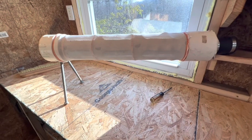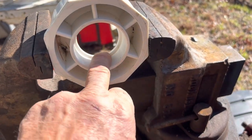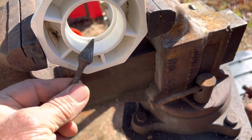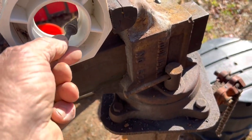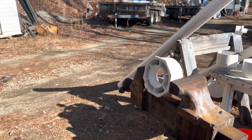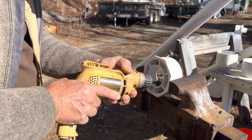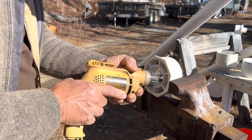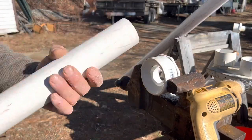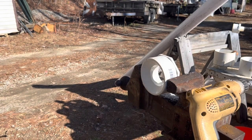Now I'm going to take this thing down there and put it in the spring. For part of this build, we're going to slide this pipe right through this thing. They've got this ledge right here where the pipe is supposed to stop, so we're going to put a plain old carbide die grinder in the drill and grind this whole ring around — get rid of it so we can slide the pipe straight through. Got it ground down, and the pipe will fit in there, so that's good enough. That's what we're after.